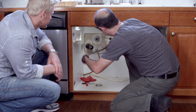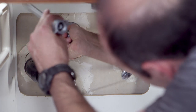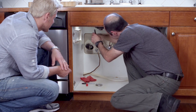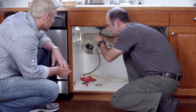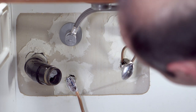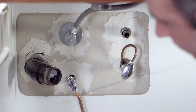Pushing on the valve, you turn clockwise from 9 to 12 o'clock. Once it's down to that mark you made, it's installed. Now, as you can see, the valve isn't fixed in place. That makes it easy to adjust the position so the connector doesn't kink. To finish, attach the connector to your sink, hand tighten the nut, and you're done.